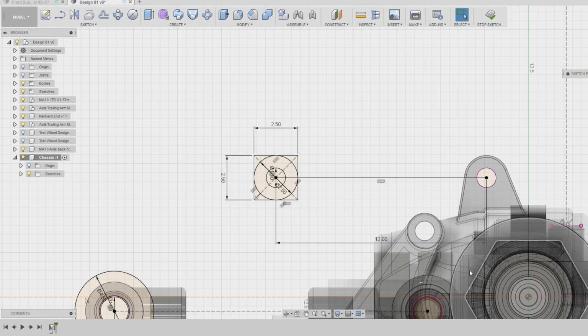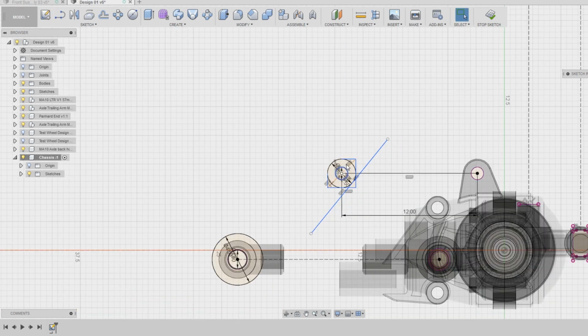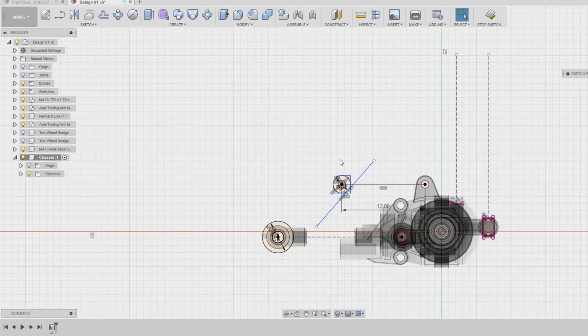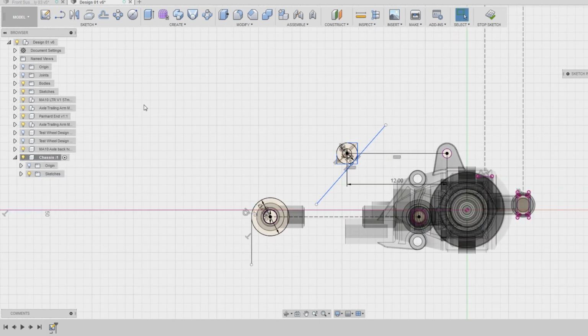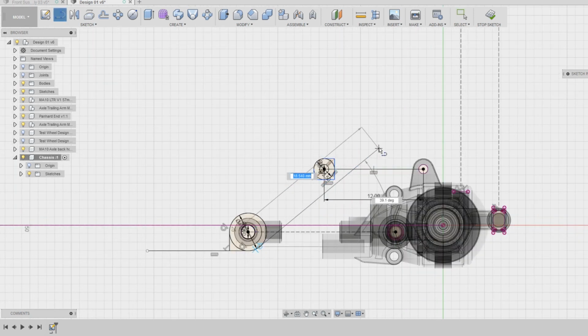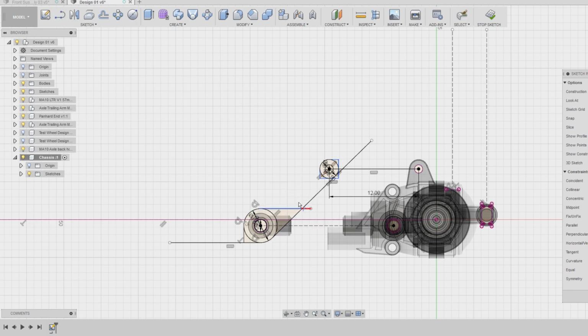At this time, I'm not overly concerned about the suspension geometry. For now, I really just want something that works. I'm making the upper link for the 3-link suspension about 70% of the length of the lower link, which seems to be pretty standard on full-scale street cars, and I figured it'd be a good starting point. And at the ride height that I plan on running, these links should sit around parallel with the ground.